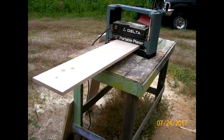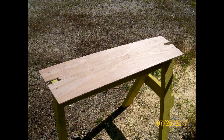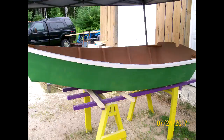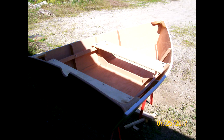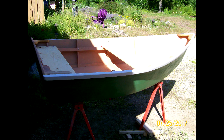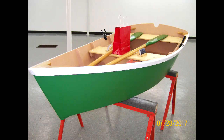I got some lumber from the local lumber yard — pine or spruce — all in the rough. I ran it through my planer to cut out the thwarts. I make templates from very thin plywood, fit them in place first, then use the templates to trace onto the wood and make the final thwarts. You can see them sitting on top of the risers. From this point I was able to put on the finishing touches, and there you go — there's the finished vessel, set up for the non-profit raffle.